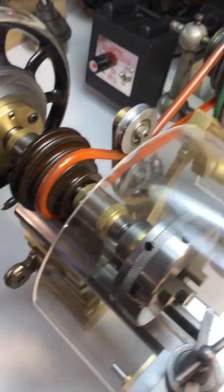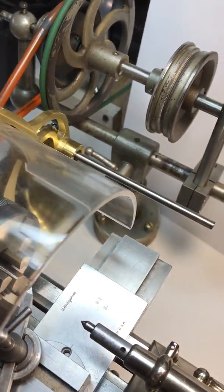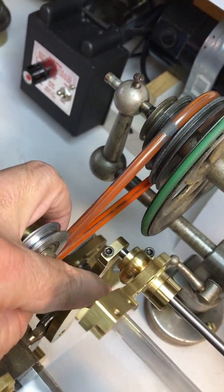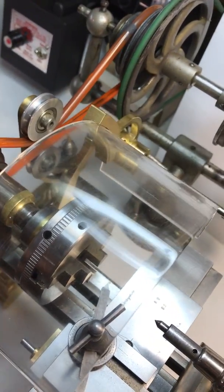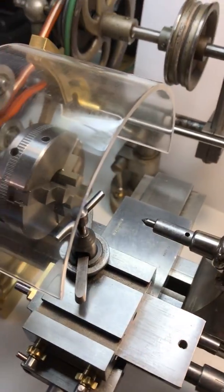So I'm very pleased with it. By pivoting the arm forward and back and also by loosening the set screw here that tightens and loosens this collar, I can rotate this to different angles, which in essence changes how close or how far away it is from the work that's actually being cut.